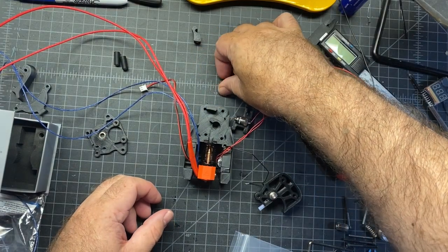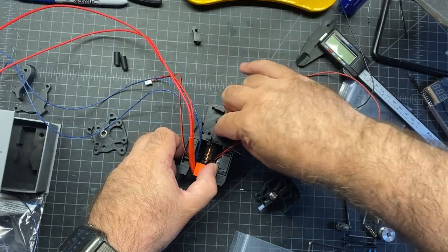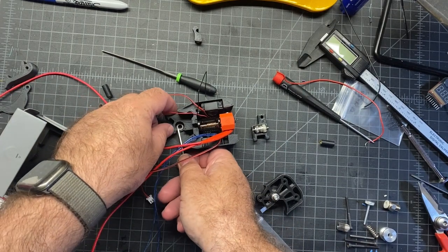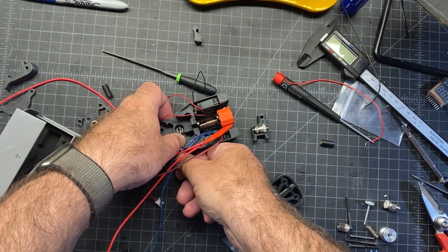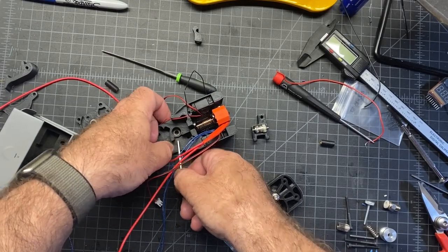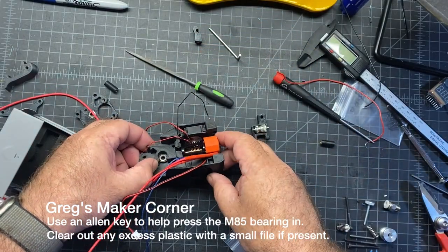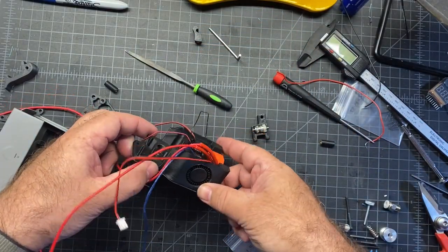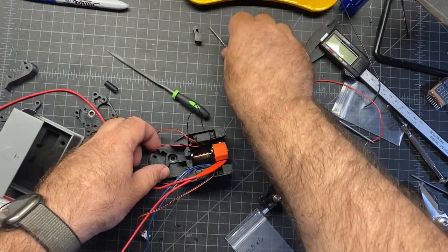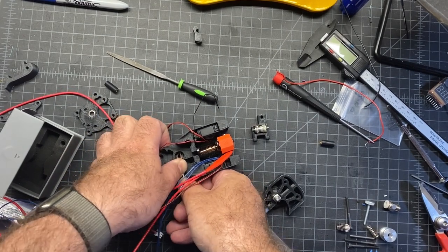Please still have your MR85 bearing because you're going to need to insert it into this little hole here in the next step. If you're like me and you have sausage fingers, the best way to get this bearing in is to use an Allen key to hold it over and just kind of press it in. I did that and got mine in. I also had a little bit of plastic in there that I cleaned out with this file — I just kind of rubbed it around, but ultimately I got it in. I think it needs to be flush, so you may have to push it down a little bit. This technique worked pretty good.